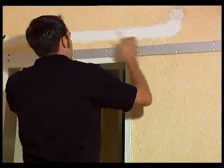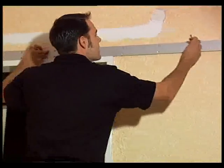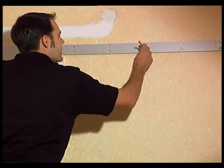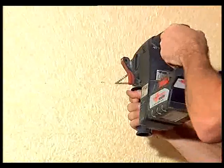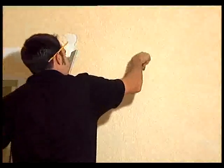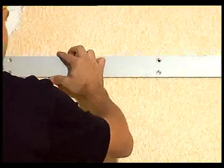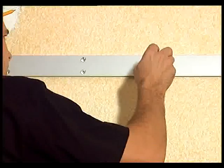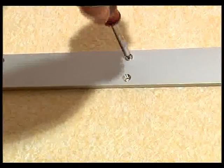Our mounting example is equipped with a shim plate. After all dimensions have been determined, locate the shim plate at the correct position. Now you can mark all required fixing holes through the holes in the shim plate. Then drill two holes apart from each other and fix the shim plate to the wall with the respective dowels and screws. The enclosed dowels and screws are suitable for concrete and brickwork. You will have to use appropriate fixing material and procedures for all other substructures.